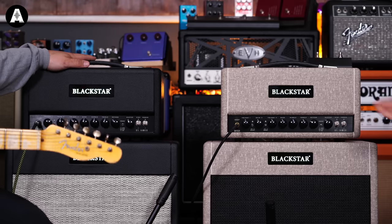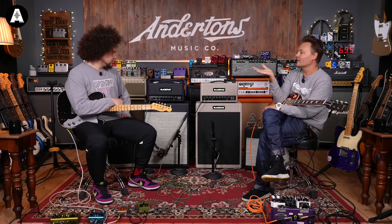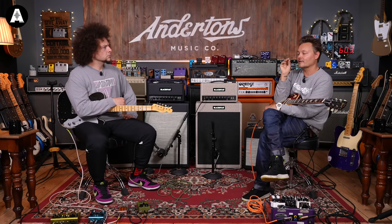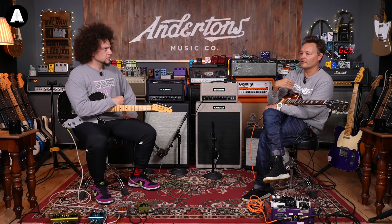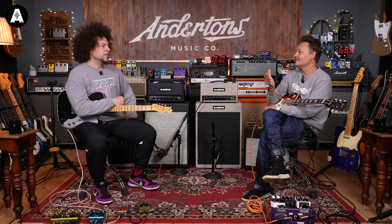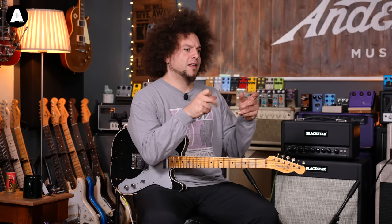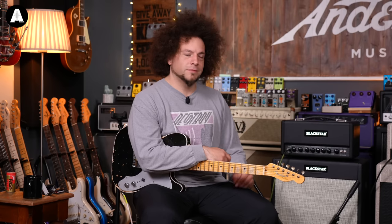Ah, I see. So that's why you've got more of that sort of British-American kind of vibe. It's funny because on my DP, I prefer the 34s as well, because it approaches gain slightly differently. I don't know what it is, but it's a nicer lower gain in my opinion, it breaks up nicer, later. I can't explain why. I think it's because they have more headroom. I've always noticed 6L6 tends to break up faster, a bit more scooped and gainy faster, whereas EL34 just kind of puffs its chest out and goes, nah, bro.